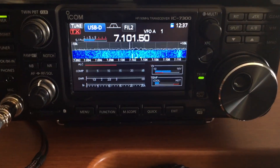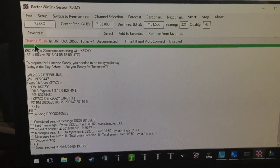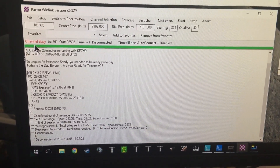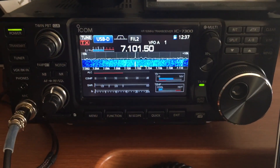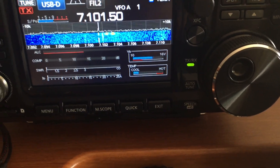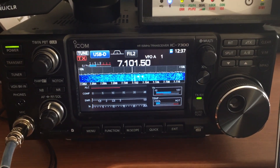Okay, that was an ungraceful disconnect, but it completed the send. That took 9 minutes and 52 seconds — lots of retries. Again, the bands are really, really bad today. But look at its temperature — this passes my temperature test. This thing can handle full duty cycle Pactor, no problems.